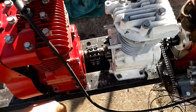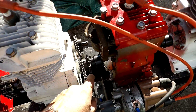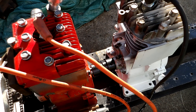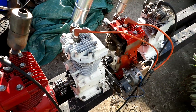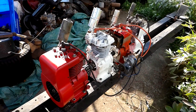Using the same technology here with the chain couplings. I have to weld the sprockets on — I don't have anything there yet. I've got the keyways cut in the shafts but I don't have keys in them yet. I have to file keys down and all that.